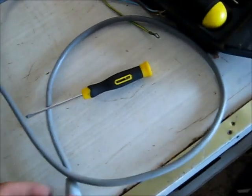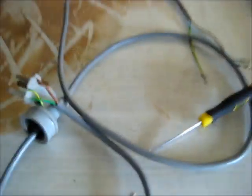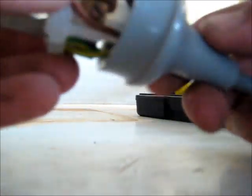The colours are the right way around. You need to hold here and pull this cord - it should not withdraw very far, staying very close to the end. Now I put the shroud back on. For some stupid reason it doesn't have a grip nut, so I'll just slide this back on. Pull that - there's a bit of stretch in it. The earth cord is obviously longer but they're all tucked back. Just push them apart so they're not stressed, then pull that back on.